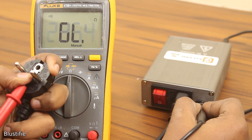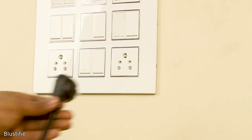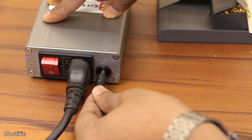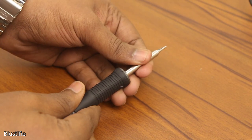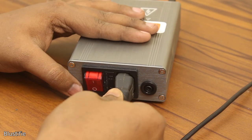But sadly it is actually not connected to the earth ground because of the AC plug they provided. In India, our outlet standard is different. So not only the binding post is floating but also the iron tip body — now the iron is not ESD safe anymore. If you change the wire with a properly grounded one, then you can use this feature.